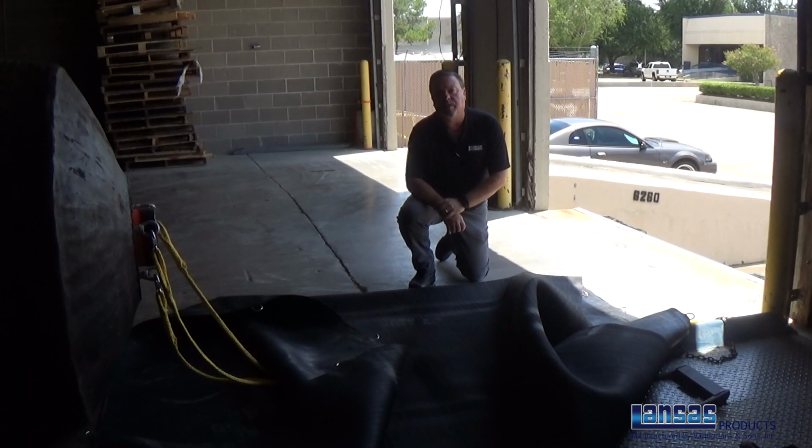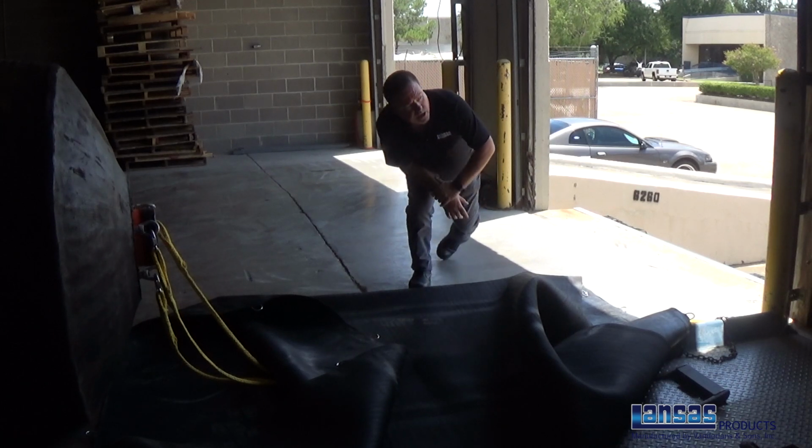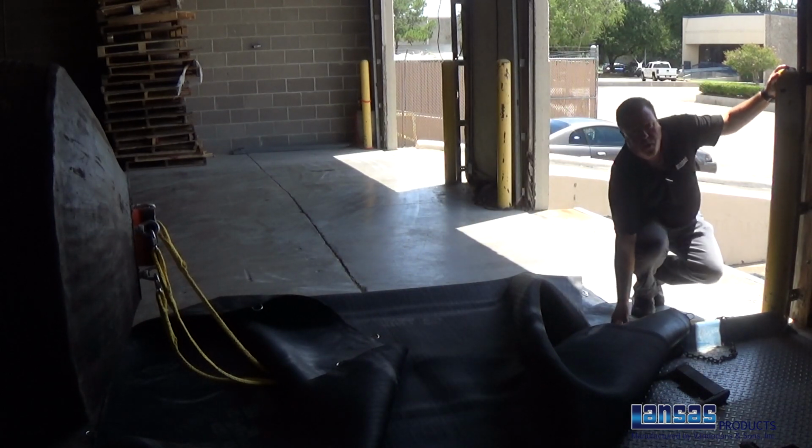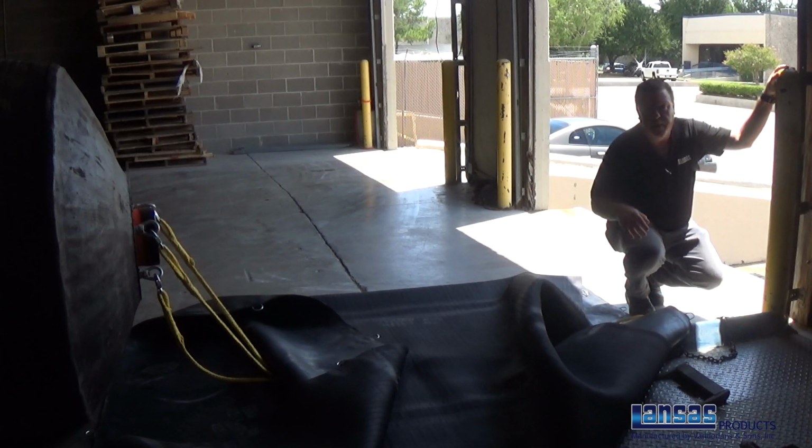First thing that we want to note as we do installation on protective sleeves, we use a secure and stable tethering point to make sure that as we pull the sleeve up, we can have the plug secured into position as we install the sleeve. So we usually secure directly to the pole. We come back with our straps that are going to go right through the plug and be able to secure that from having any movement once we start to pull the sleeve up and on.